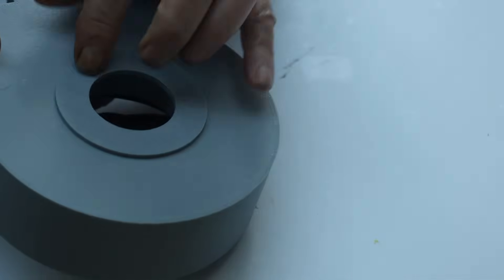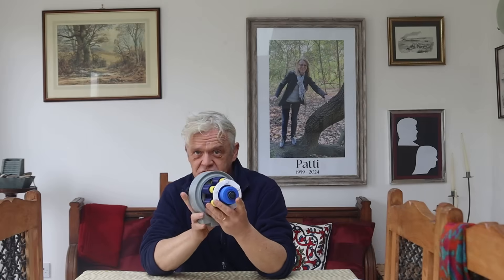On the back we glue in a plate right there. We can then slide this into place in the ground wheel, and it acts as a ground wheel and part of the case. There's another recess because the only thing left to do is put on the output wheel — the output wheel is also going to want to precess, and we need a bearing in there to let the output wheel rotate and take up the thrust force in either direction. So in that recess we pop some more rollers.